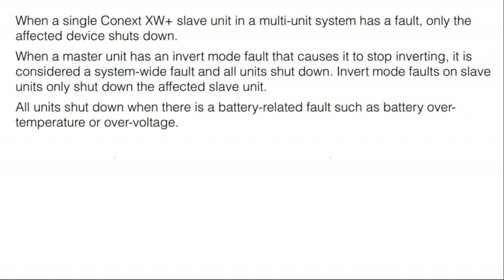Well, what's not foolproof about these systems is if there's a failure in the master inverter, you'll still lose power to the home, and then you'll likely have to go and reprogram one of the slave inverters to be the new master inverter while the master inverter is being replaced. And so, just because you have two battery inverters that are double stacked and parallel Etherneted together, does not mean you have a completely foolproof system that won't require any technical knowledge from the homeowner.